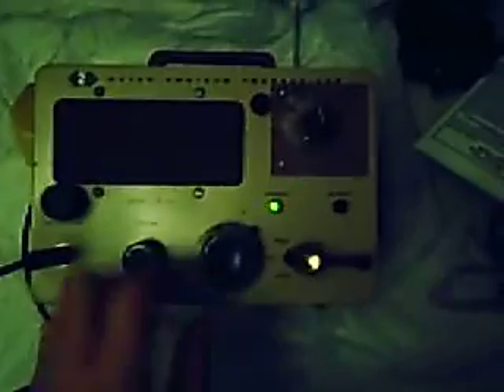This is a transmit crystal selector. This transmits on 146.520, and when it's hooked up to a power supply and you hit the transmit button, the output light comes on. So it's actually just like it would work back when it was a 1959 AM transceiver, but I wired everything up to make it an FM transceiver.